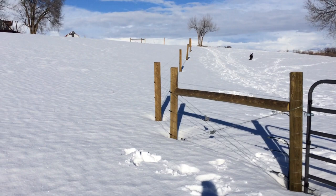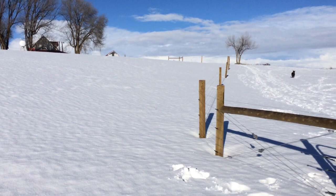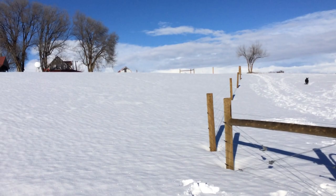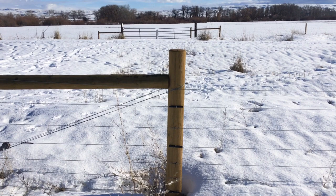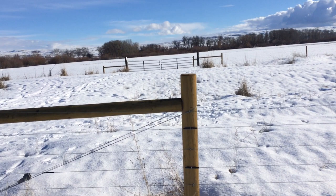When the ground started getting hard we ended up having to get an auger. One thing I learned was I can't drill straight holes with a one-man auger, so we had some crooked posts. In a way this fence acts like braces on your teeth, and when the ground softens up I'm wondering if some of the poles won't straighten themselves out a bit. These posts are seven and a half feet long and about three to three and a half feet in the ground. You need that kind of depth — you can't put this kind of tension on a T-post because it'll bend.